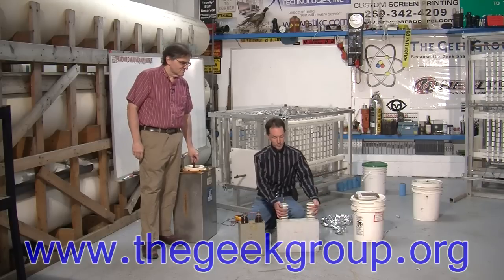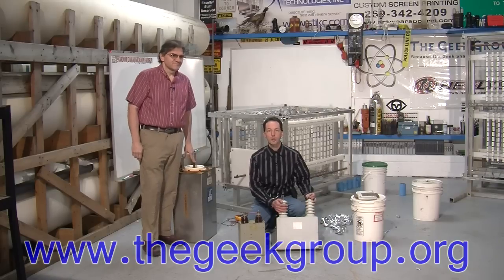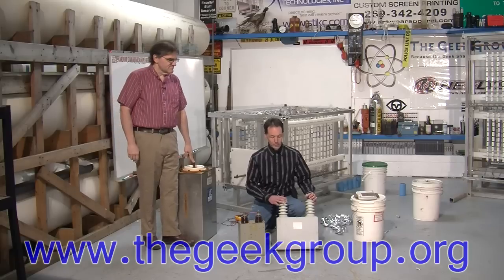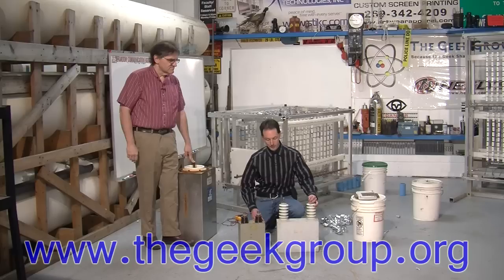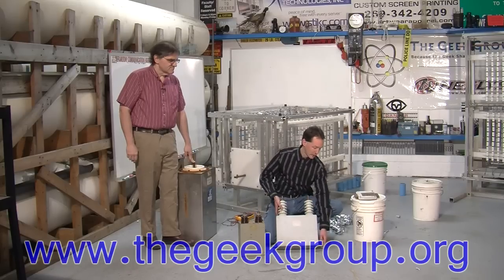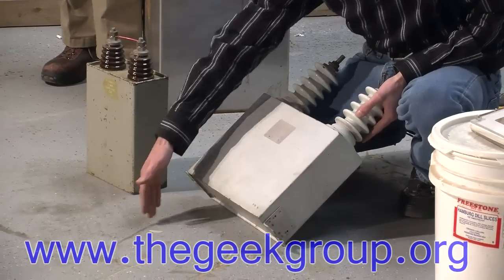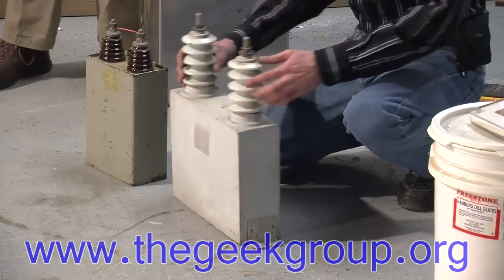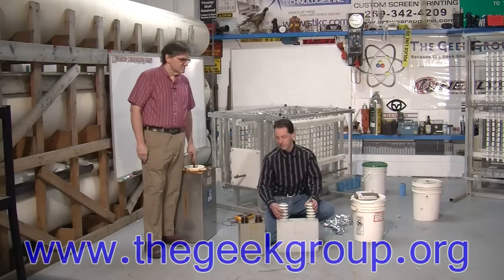This is a PFC cap. It is used for commercial power distribution, like Consumers Power, Detroit Edison, and all that. They use these for power factor correction for factories and stuff like that. It is not pulse rated. It looks kind of like a pulse cap. They're really easy to get mixed up, but it won't work. The big giveaway is they always have ears on the side. They're either this size, usually, or twice as deep, and the wings are always at the same point. But this is a PFC cap. It's useless. If you try and hook it up for a Tesla coil, you're just going to destroy the cap. And if you've got a really high power coil, you'll just blow this up.